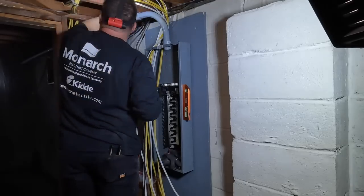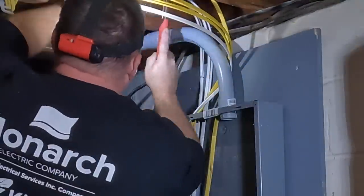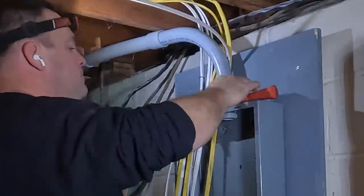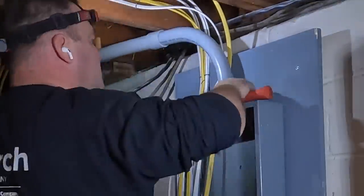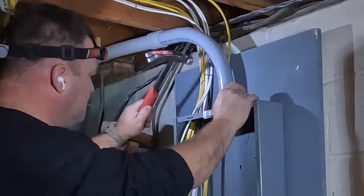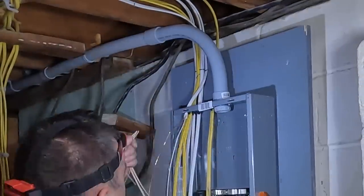When you're loading circuits into the new panel, think about what you're doing before you put them in instead of just throwing them in quickly. I'm using black button connectors on the top here and I want to get at least one staple on each of the cables. You're only allowed to have two cables laid flat with one staple attached to a framing member. You want to staple them and align them in a neat, workmanlike manner. Even after all these years, I make mistakes.